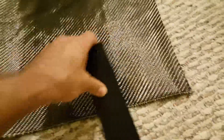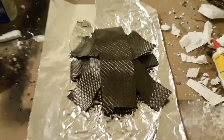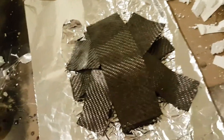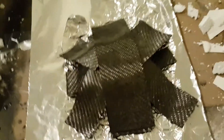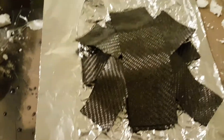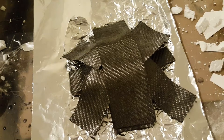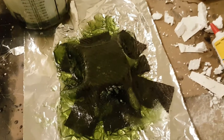This is a finished carbon fiber piece — not a really good one — but you can see it's extremely solid. If I try to bend this, it's really hard. It's a very strong material. Because my shape was really weird, it was hard to get one big sheet and form it, so I had to cut multiple strips of carbon fiber and put them on top of each other. Hopefully when I apply the resin, it will all soak together, though it won't look great with weaves going in all different directions.